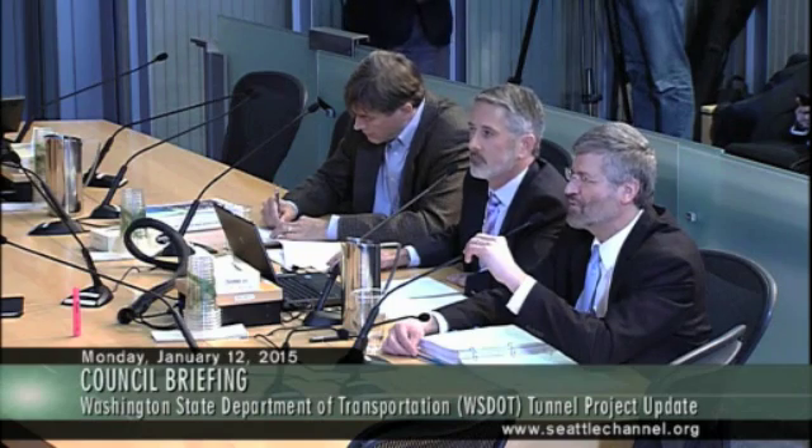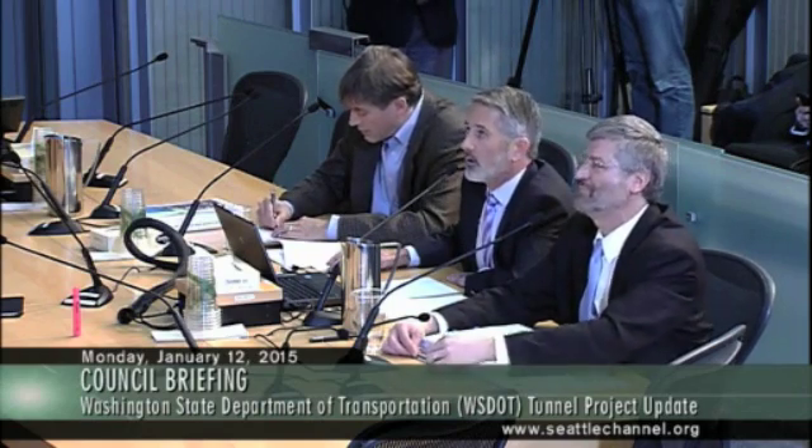The slang term for this is 'repair as you go.' At every hold point, they look at that, measure inclinometer readings to see how the shaft is performing, and look at the soil in the shaft. There's a variety of things the quality assurance and engineer of record teams do to evaluate progress and verify everything is functioning according to the original design before that hold point is released.